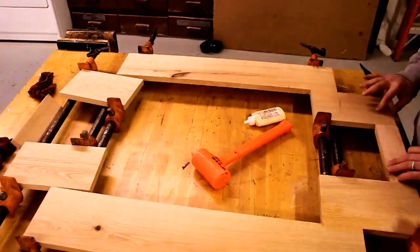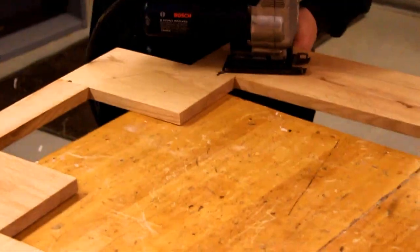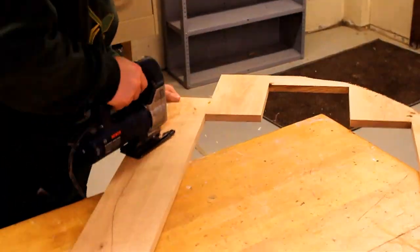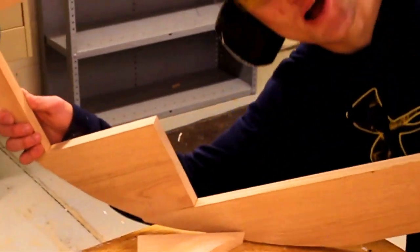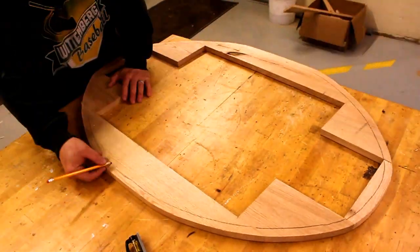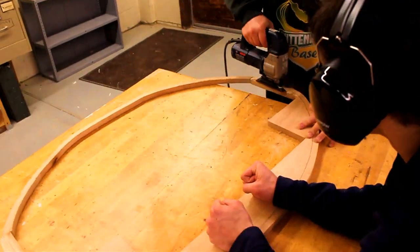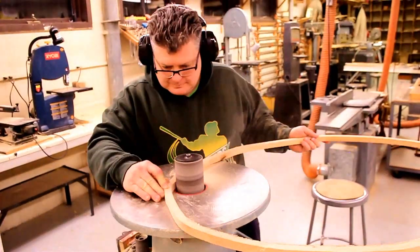After these pieces were done drying, we took the table top and laid it over our soon-to-be rim, tracing it with a pencil. We then went along that line and carved out our trim piece with a jigsaw. We kind of winged our inside edge — Dad just kept his finger about an inch off the outside edge, ran the pencil all the way around, and then cut it out with a jigsaw. Once that was done, we sanded the inside edge with our oscillating sander.